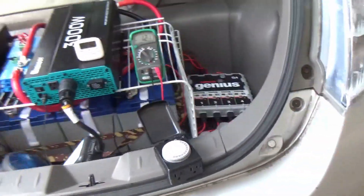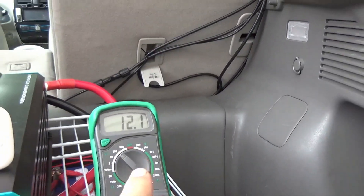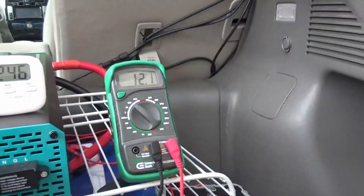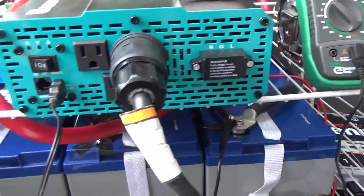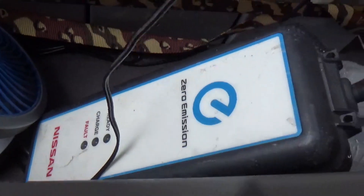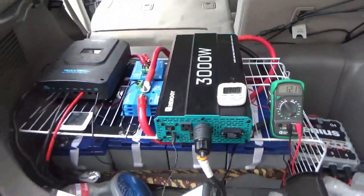Okay, that's freaking sweet! We saw our voltage jump from 11.6 back up to 12.1. That is because the inverter shut off and when that load came off the batteries you effectively get a higher reading. Now the solar panels will start charging the batteries back up. You can see the car charger has shut off — we're not even getting that yellow fault light, because voltage has been completely cut off to the inverter by the smart battery protect.